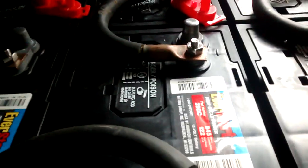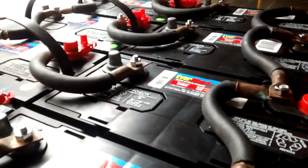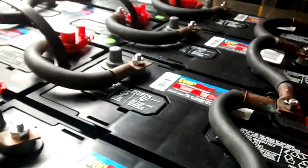You can get away with it for a little while, but your bank will fall down to the weakest voltage of your weakest battery. So you do them all at once. These have never been cycled yet. I tested them and they were all about that voltage. They're all equalizing right now. So next step is hook them up to solar — I'll probably run that as a video as well.